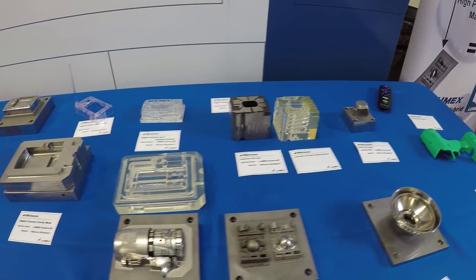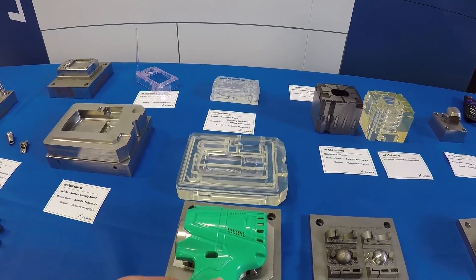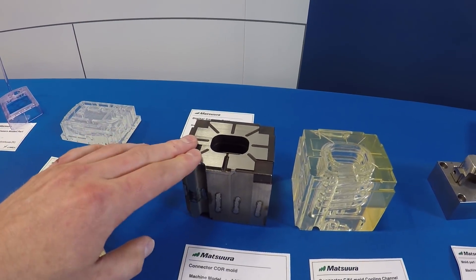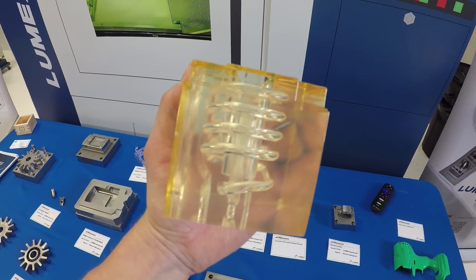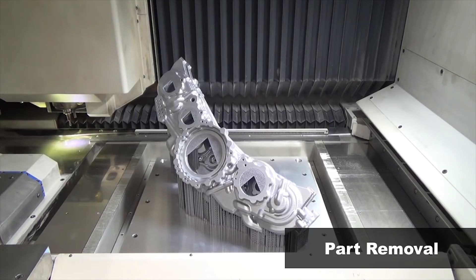This is the part — this is literally how it works. It doesn't fit because of the shrinkage from injection molding, but that is really cool. They've got an example here of a mold along with a transparent sample that they 3D printed on another machine, just to show the cooling loops. That's the trick — they're able to do really complex geometries that save you from having to do complex five-axis work or sinker EDM work, but also things you could never otherwise do with those nested cooling loops.